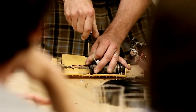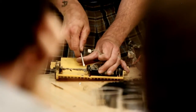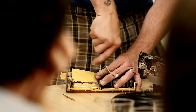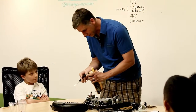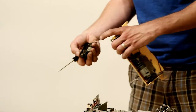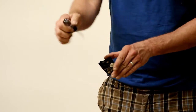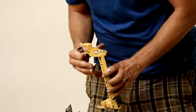How difficult was the software to write? Incredible - it's a hugely parallel problem, listening to all sensors and responding in real time. Think of the cliff detector needing to slam the robot in reverse very quickly. Looking at the gearbox: it's a straightforward spur gearbox with specially designed gears. Originally none had bushings, but the shafts would get hot and literally chew a long slot. We learned we should put bushings in.